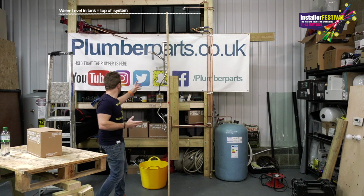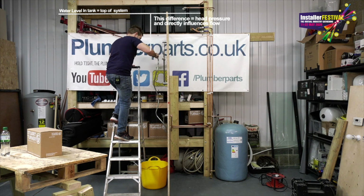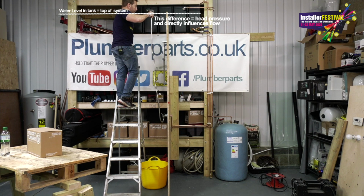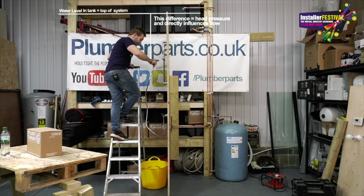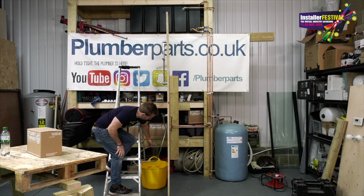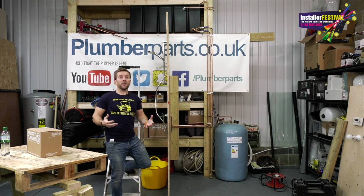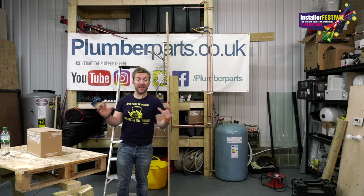So if I go further up, say I get my steps and go further up with it, the flow of water is actually going to get slower and slower and slower till it stops altogether, because the shower head is now roughly almost at the same level as this tank up here. And it goes the same way if we get lower and lower and lower. We're going to find, look, you get even more out, which is why in some houses the ground floor kitchen has got loads of water coming out, but the upstairs bathroom is really, really struggling to get any water through and they're getting really upset by it.